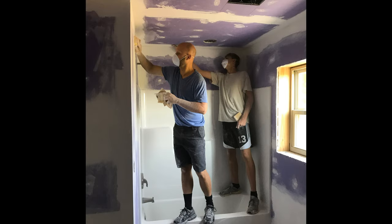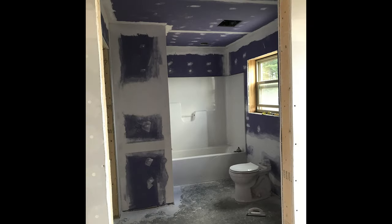Remember, the less you put on the less you have to sand later, and you'd be surprised how long it takes to sand a little ridge of mud that has dried. We sanded way too much in the bathroom. Remember to use moisture-resistant wall board in the bathroom, which is specifically made for areas where there will be moisture.